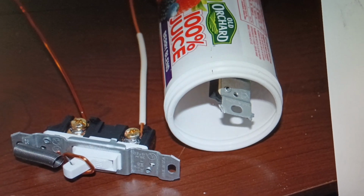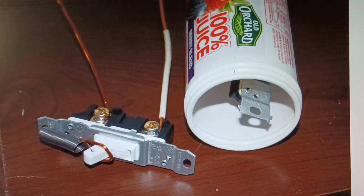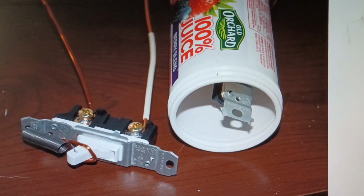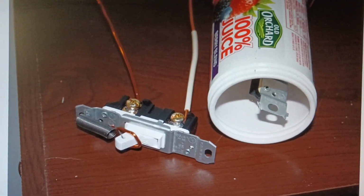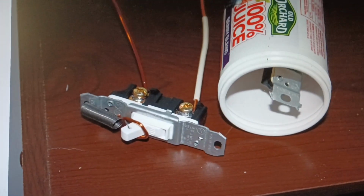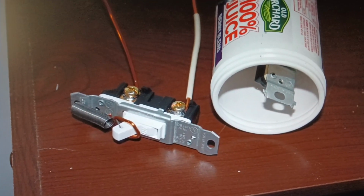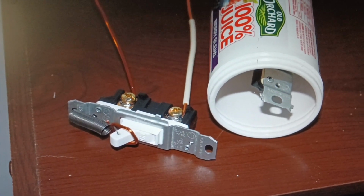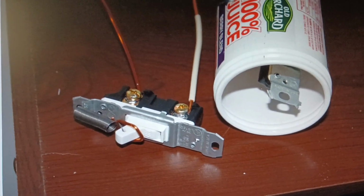The wires go to the pieces of antenna wire that are separated by an egg or a hot dog ceramic insulator, whatever you want to use. I use the longer hot dog insulators. So, there's one of these switches in each of the arms. The cords run along the antenna through loops of copper wire that kind of hold it in place, down to the feed point and then down to the ground.